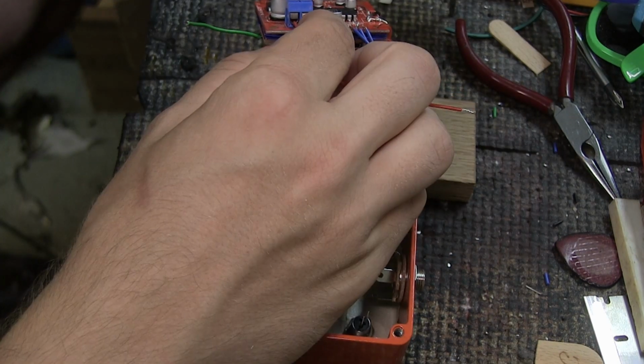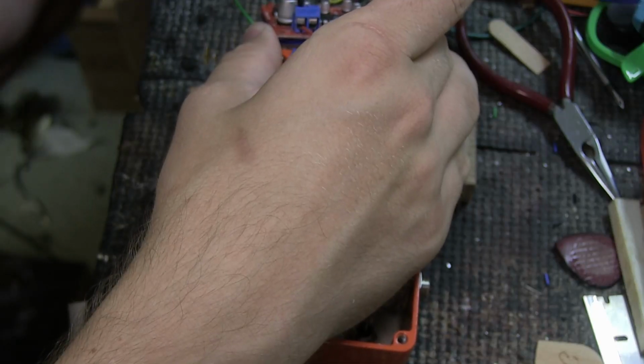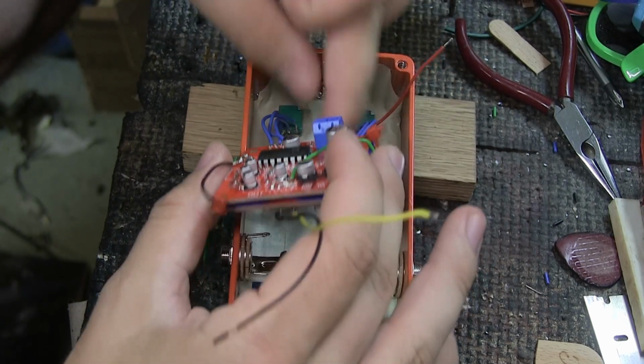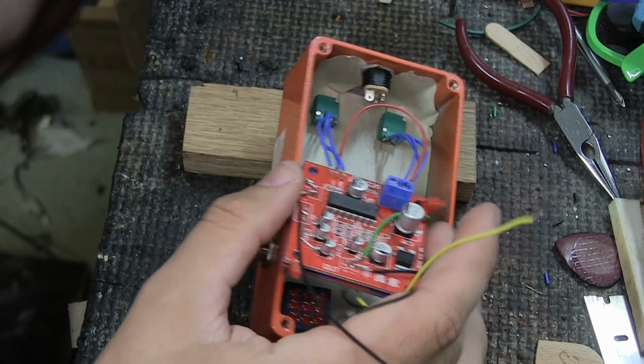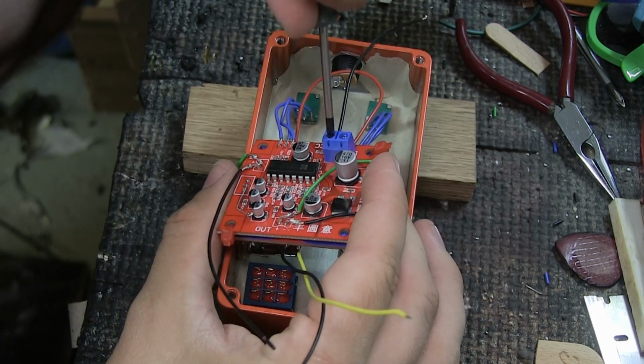I'm just going to push a wire in here to this thing and tighten it down so that we have our power plus. And I'm using this wire on both like a loop so that I can cut it in the middle and solder in place. And I'm doing the same thing with this ground wire. And just so that you know that I did it, I also pre-tinned them.